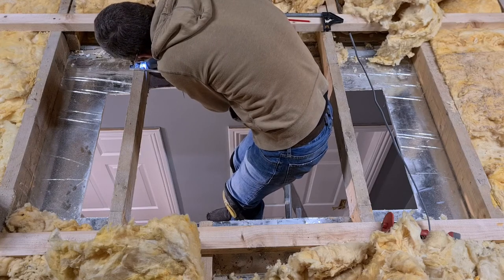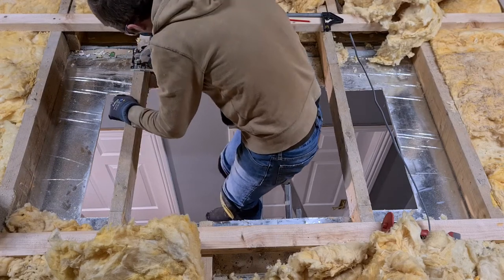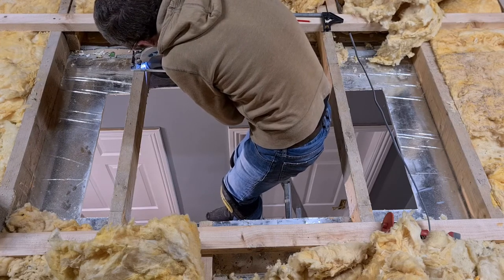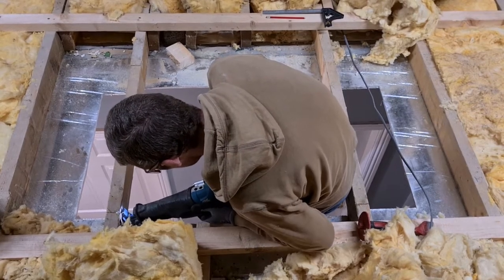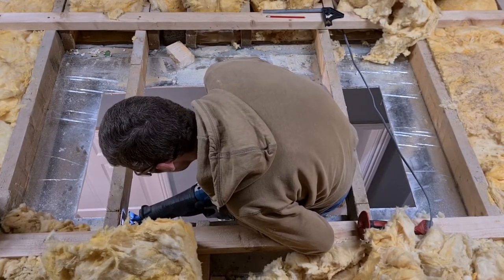As you can see, there's an existing electrical cable that will have to be extended to accommodate the new frame. Try to avoid additional electrical and plumbing work if you can, otherwise the job can become expensive. That's why it's important to plan the layout in advance before making any modifications. If you can move the frame a few hundred millimeters, it could mean avoiding unnecessary electrical or plumbing jobs.